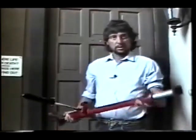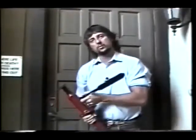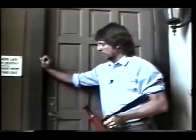Same principle, it's a hydraulic jack. Easy to extend the legs all that distance, get it in tight on the jam. Got a handle, folds up, store, hydraulics, on and off. This will put out about 4,000 pounds of pressure in order to spread the jam. That is enough to spread most jams without too much damage. Will not spread heavy metal jams in large buildings.